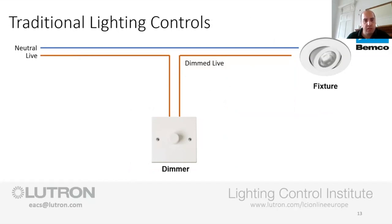Now, I don't know if you've ever seen issues where you put an LED lamp in and suddenly you've got a dull glow, or sometimes it'll charge up like a capacitor then discharge, so you get a wee flicker and flash now and again. You tend to see that on lower wattage LEDs, such as your plinth lights, your stair lights and stuff like that.